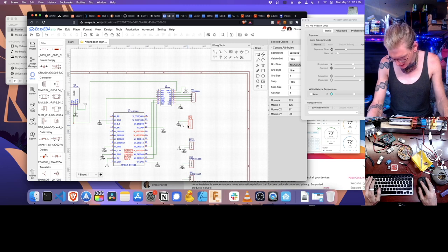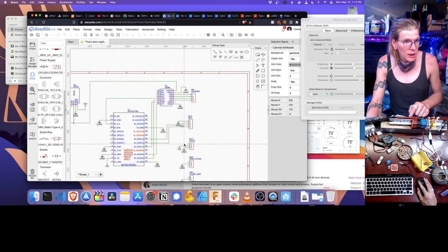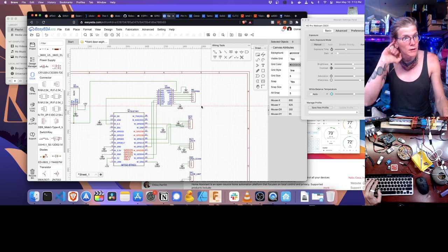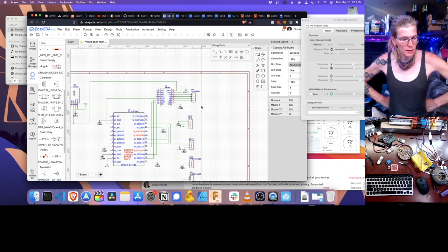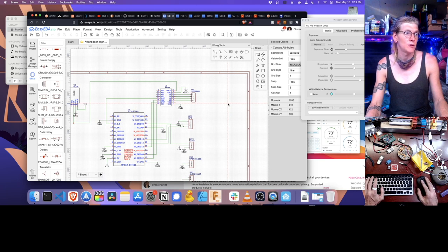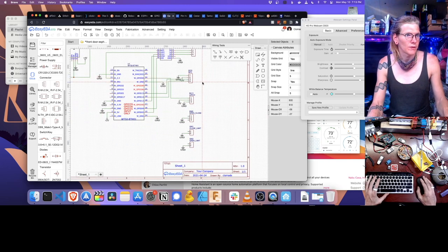Okay, let's move up to our NFC. Our SDA goes to IO15, and our SCL goes to IO14. Cool. Yep, that goes up there. Our relay lamp goes to ground, and our signal is IO0, which is output only and used for programming. So we are going to eventually need to figure out a way for those two pins to coexist. I would probably suggest putting a button on there for programming. But at least for now, I think programming is okay to do without actually removing the board from it. So yeah, hopefully these also come before I move.